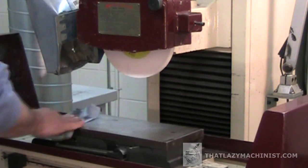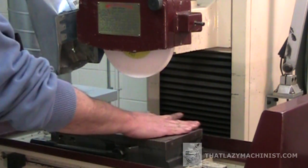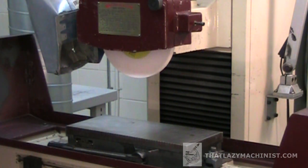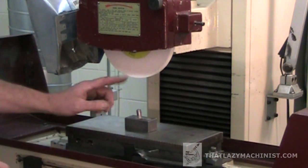Make sure that you wipe down the table really well, and using the palm of your hand — because it's very sensitive — make one last verification to make sure that all our problems have been resolved. I can now lock my table in the longitudinal axis and install my diamond dresser for the truing operation. Dressing and truing a grinding wheel are two very similar operations, but the objective is quite different. When we dress the grinding wheel, we're sharpening it. When we're truing the grinding wheel, we're making its outside diameter concentric with the axis of rotation of the machine's spindle.